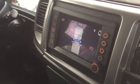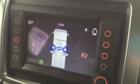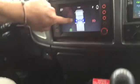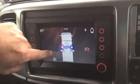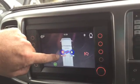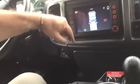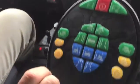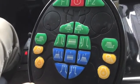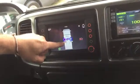Now you can sit here and set up your sweep mode. You can see everything there in the off position, all in blue. If I wanted to engage my channel brush, I'd push the button here, it goes to red for standby. Obviously I'm going to want my suction nozzle, red to standby. I might choose to use my wide sweep, red for standby. Obviously we're going to run a little bit of sweeper water, so if I push this one here, that's your basic water button setting. That will enable water to your channel brush and basic water into your uptake tube.